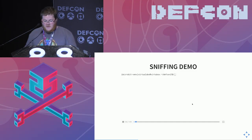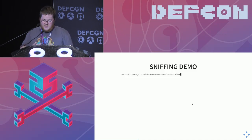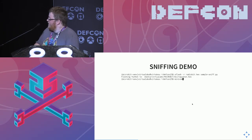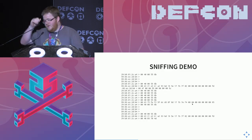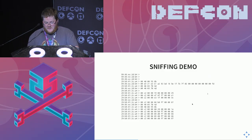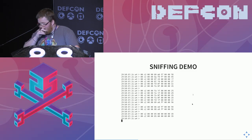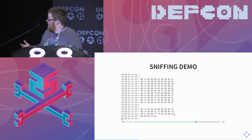So first of all, I am programming my micro:bit with my specific firmware. I tell the micro:bit to use a specific Python file I wrote. This is the file I showed you just before. And by connecting to the UART with a specific baud rate, I am getting all the stuff printed by the micro:bit. So here you can see many devices talking over some kind of ESB protocol. This is a Logitech wireless mouse, and it's sniffed without any problem by this little hack. So here it is.